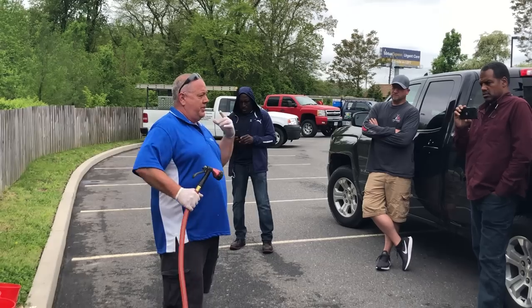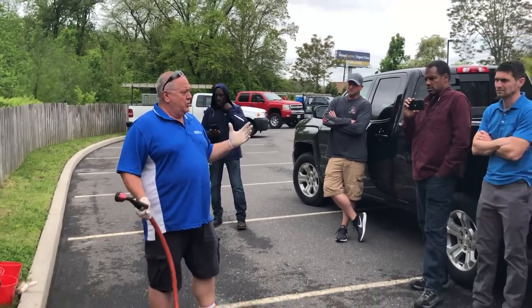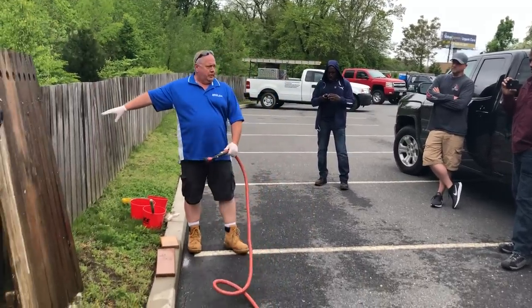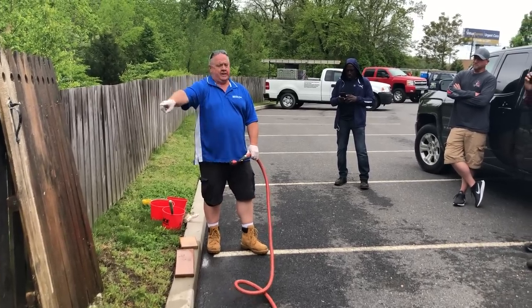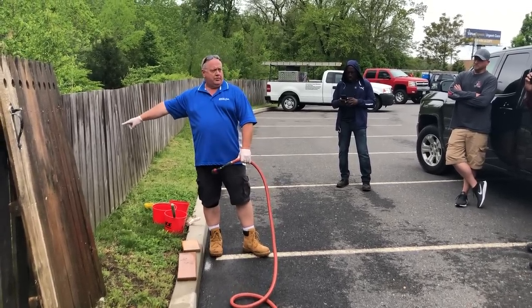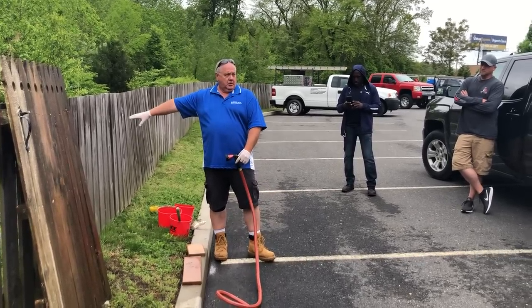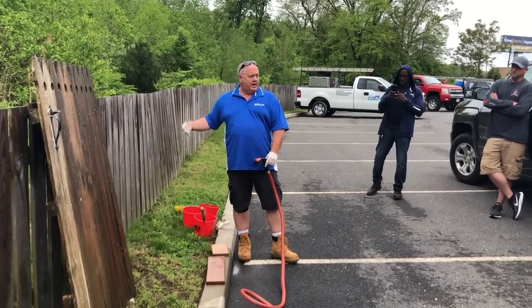If I say restoration, as a customer I'm thinking, okay, well, I'm paying more for this service. So when you do restoration, you're taking those gray wood fibers and removing them. The sun has already decomposed them. So we want to get those surface gray fibers off. Those people that are just throwing bleach on the wood are just bleaching those wood fibers. Those wood fibers are already ready to come off.